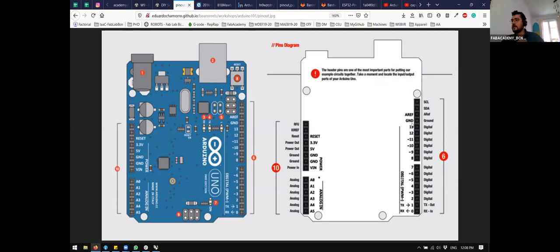Not all boards can connect everything on all pins. Luckily, Arduino is quite straightforward on that. One side is for digital connections — all those pins are digital, meaning you can process digital signals both for input and output. On the left side you have A0 to A5, which are for processing analog inputs or outputs. Even if it says 'analog in,' you can also do analog out. It's quite important, but this is the simplified view.